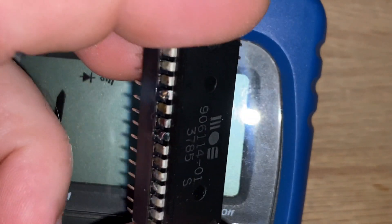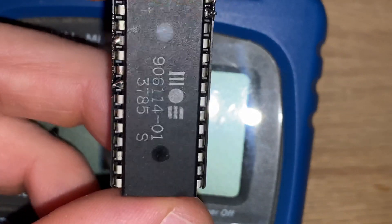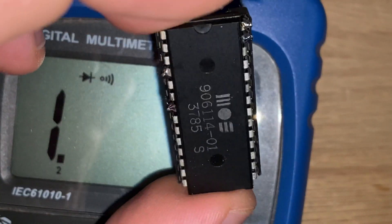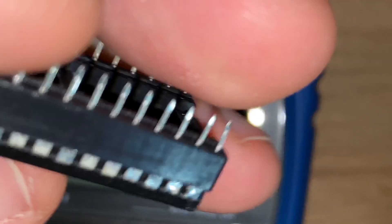So that's just an efficient way — or I don't know if I'd call it efficient — but it gets you back in business with an otherwise non-functional chip. These pins are so brittle, they can break off. You take them out, you put them in repeatedly, it takes its toll on the chip. Eventually that pin, being bent back and forth so much, it's going to come off. So if you need a quick way to fix that, I would suggest just putting it into one of these sockets and soldering the pins in. That's it.